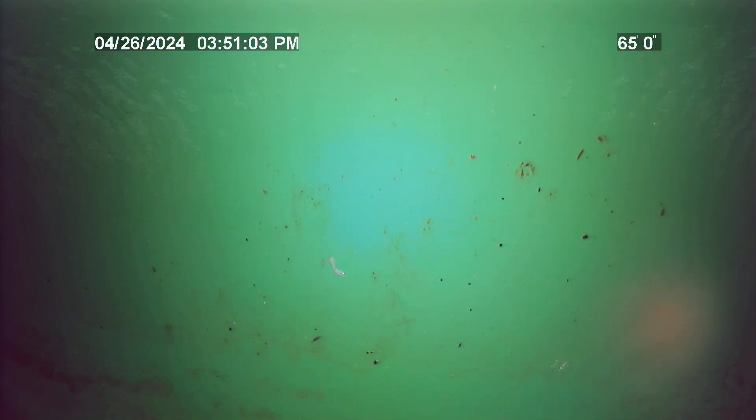The tap at the city main is approximately 65 feet from the exterior clean out. The sewer lateral in total at this residence is approximately 126 feet in length. The entire sewer lateral is all PVC with no major issues found during the time of inspection.